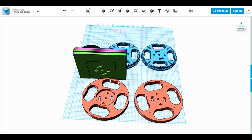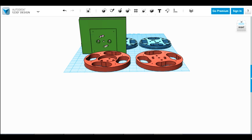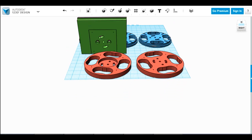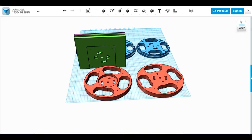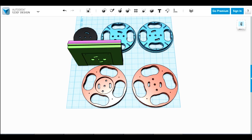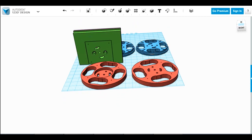On the outside we've got these red parts which are basically going to be printed and acetone welded together. I've done them in two halves so the prints aren't too high and they don't warp when printing. Essentially this makes up one hub which holds the legs on. We've got these curve-shaped grooves in those parts and in the plate part, so we've got studding that's fixed on the plate and some that's fixed on the hubs which rotate through those slots. That means we only move the leg 36 degrees and we've got end stops for when the droid is standing upright on two legs and when the legs are slanted to 32 degrees in three-leg mode. I've also cut these big holes out in the red and blue parts to save filament and help stop warping.